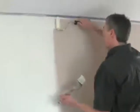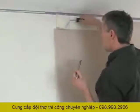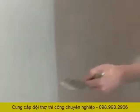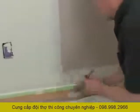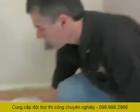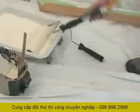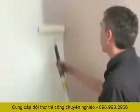Again, I've got my small roller full. We'll roll a little bit out on the ceiling, roll through to get our good coverage again. And I'll do the same thing at the bottom. Brushing, covering up that slick brush texture. Lay our small roller down. And again, this is where we talk about, boy, it'd be great to have a second person when you're doing this. One person could do the high and low cut in, and again, all this paint is just flowing nice and wet.